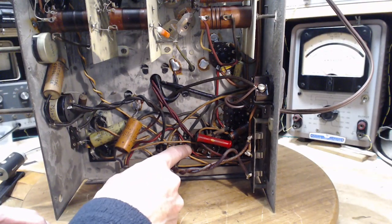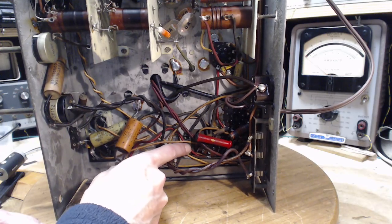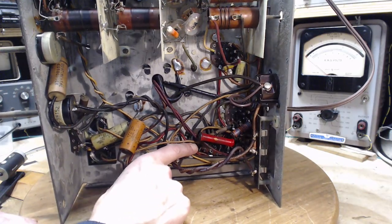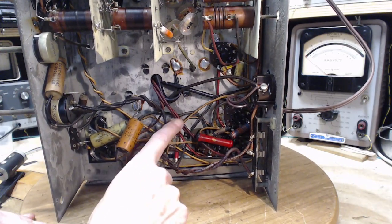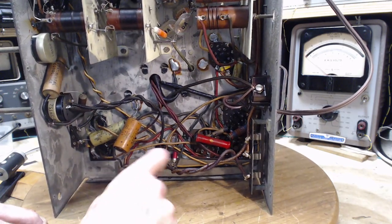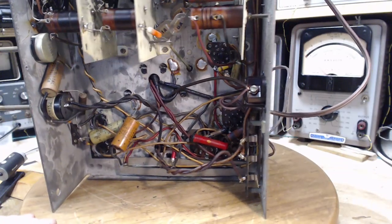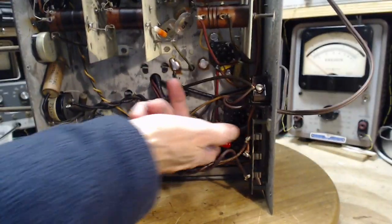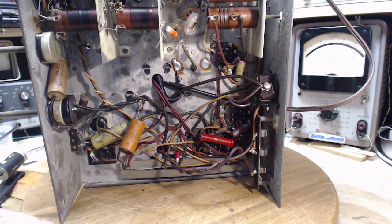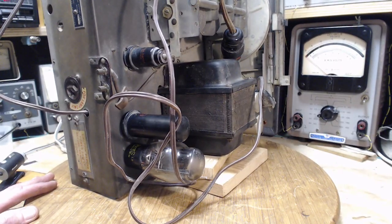So I see 1 wire. I see this is tied around to this other pin here. So 2 pins fed from 1 wire. So 1 wire here, it's coming right from this filter capacitor. There's another wire on it going over to the rectifier tube. And I just can't really see clearly what's going on up in there. I think you gotta have 2 tubes. I don't think a 6L6 is a 2 tube in 1 tube. I don't think you can do push-pull.